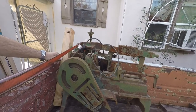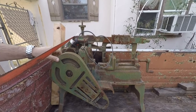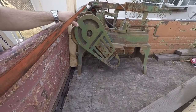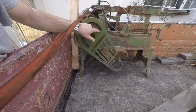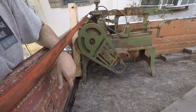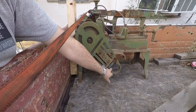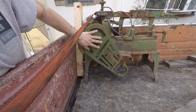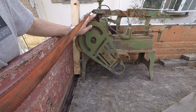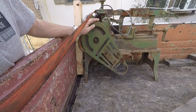That's it for the survey on this thing. There are two ways we could go about fixing the guard: we could torch out a piece of steel plate in that shape to fit that size, and then either nickel weld it or braze it in. Although, anytime you're heating something like this you're always afraid of cracking something else. Other than that, this thing is in pretty good shape really.